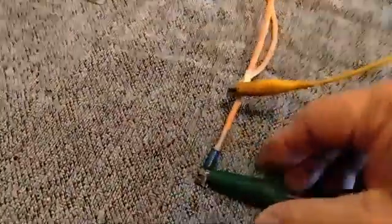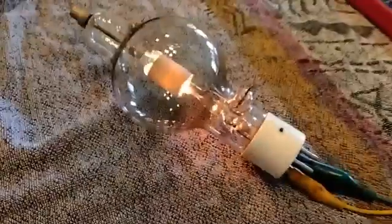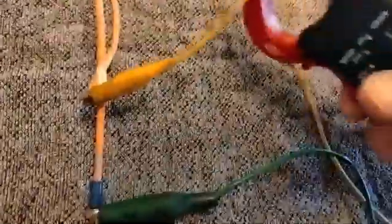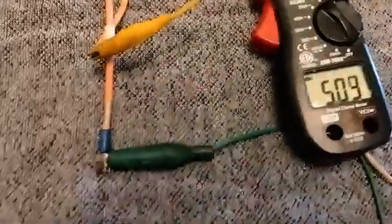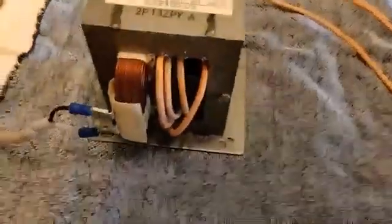Let me scoot this little radioactive tube over here — and yeah, it really is radioactive. Now I clip those on and look at that. We've got four volts, five amps on the secondary, and over here on the primary still in the 10-amp-plus range. So we've got five amps, four volts on the secondary, and I'm not going to grab the volt meter — you'll have to trust me — that's almost exactly four volts, five amps, with over 10 amps draw on the primary.